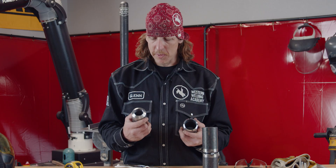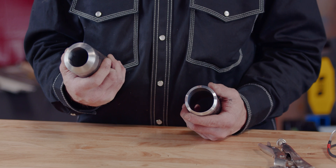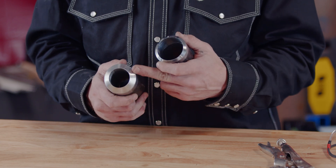Hi, my name is Glenn. I'm a pipe fitting instructor here at Western Welding Academy. Today we're going to be transitioning some pipe — we're going to be making this wall thickness match up with this wall thickness so we can get a good quality weld. We've got a piece of double-extra-strong 160 wall over here and a piece of schedule 80 over here. We'll transition this one out to match up with schedule 80.